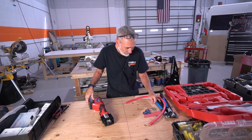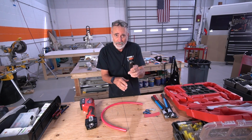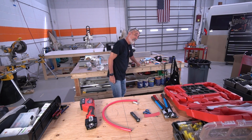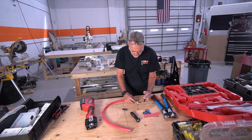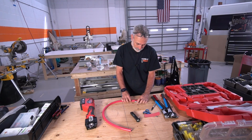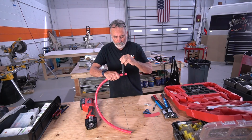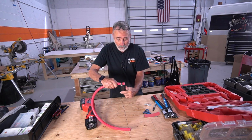So first you've got to prep your wire. I bought another little tool that I'm testing, because the other problem with working with 4-aught cable is it is very difficult to cut the skin off of this wire without ruining it, without cutting away some of the strands. So this tool is made to strip off the wire at the specified point you made your mark.